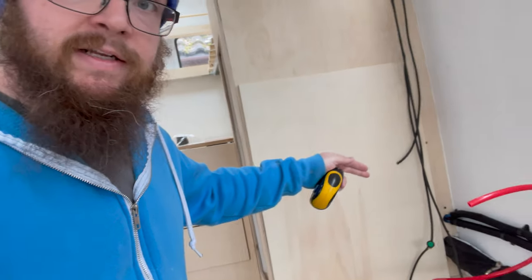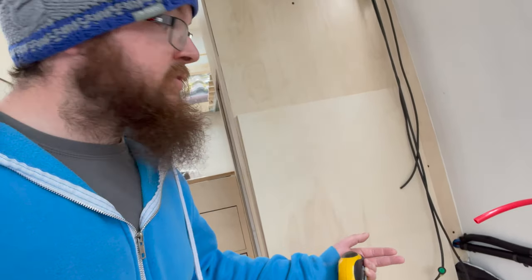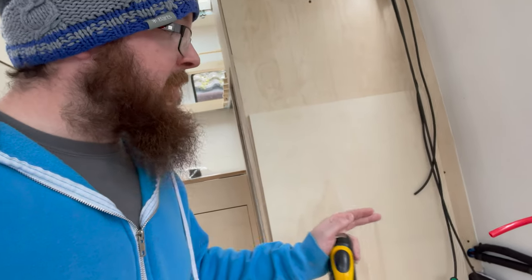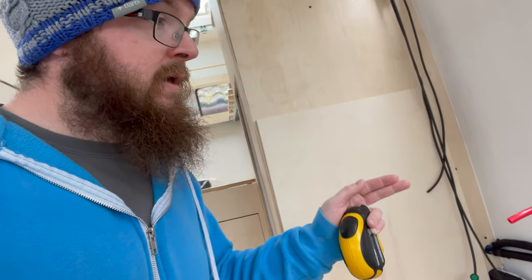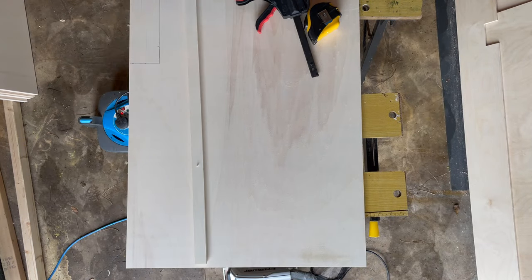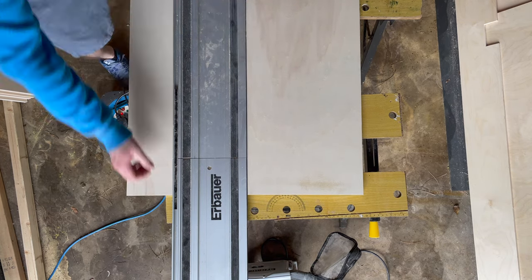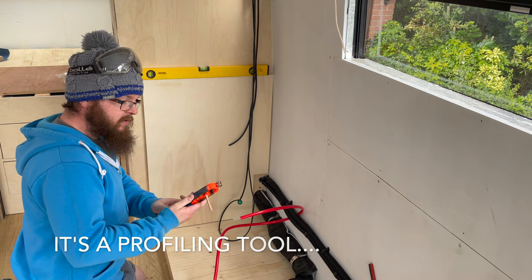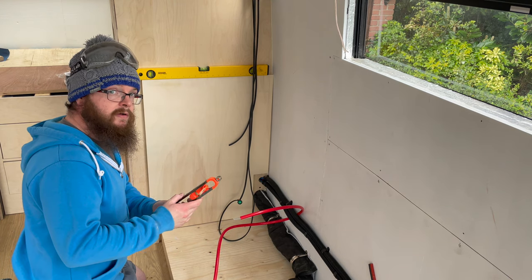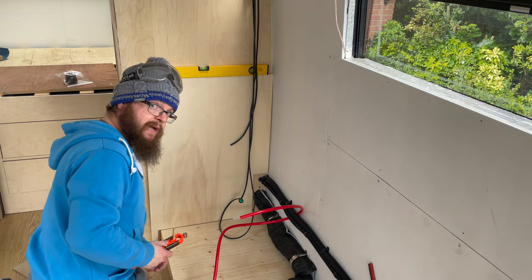What I'm going to do is cut it 25 centimetres up and 7.5 centimetres in, basically creating a big wedge out of the back of all of them. It sounds dramatic but it's not going to take away from any of the strength because there's a whole panel there. What it will allow me to do is push it all the way over without fouling anything, and have room for the waste. On this occasion I used a technique new to me — I used the edge of my plunge saw rail to guide my jigsaw. I also bought one of these cheap jigs — though I'll never doubt my piece of wood again!